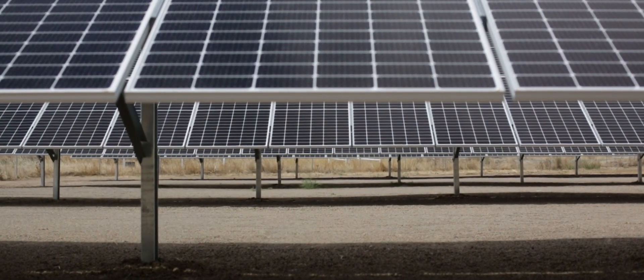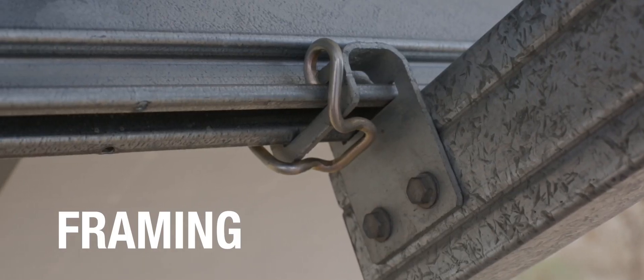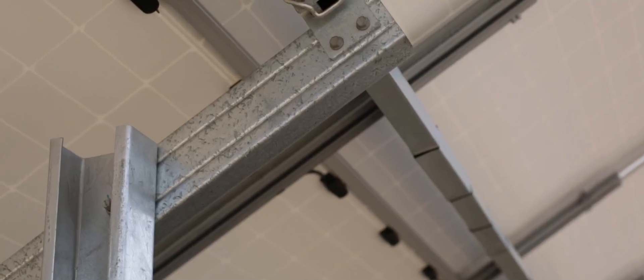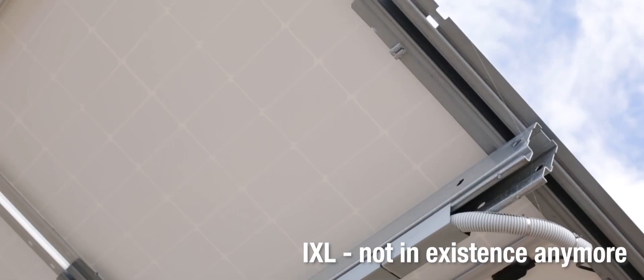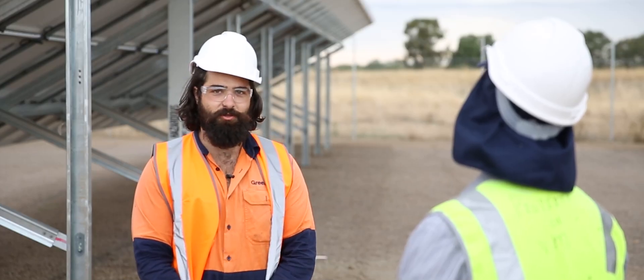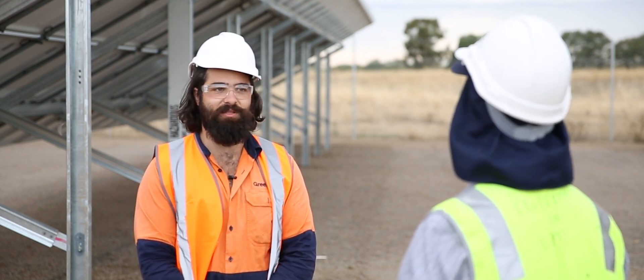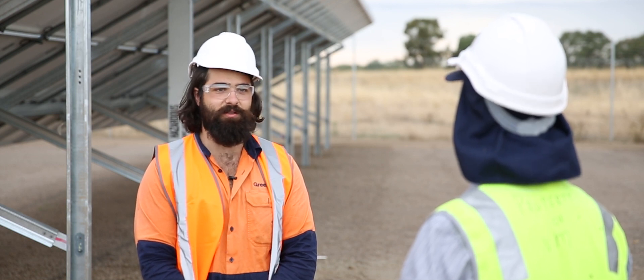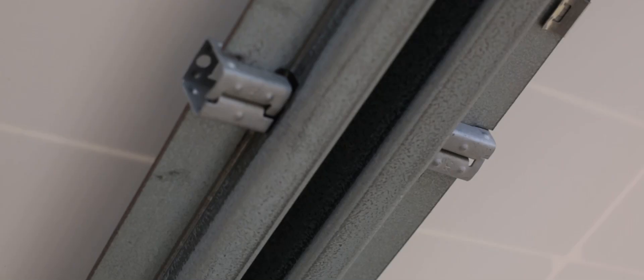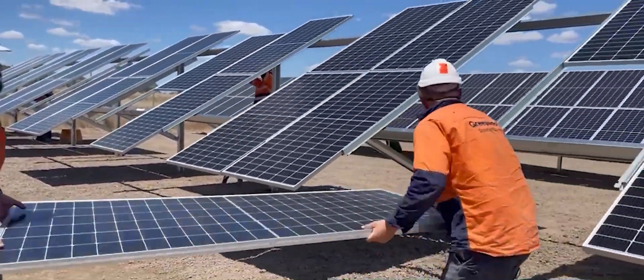That way there's minimal risk of them damaging both sides of the panels and the structure. We've also mitigated shading by probably twice what we need to. The racking system is an IXL-made racking system — IXL being one of the oldest companies in Australia. It's made specifically for the panel you choose to use, so you have to mention the panel and send them the data sheet with all the dimensions, and they'll manufacture the racking to suit.